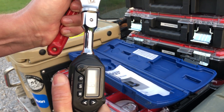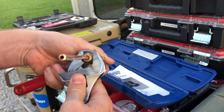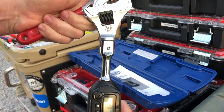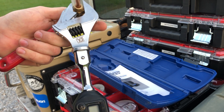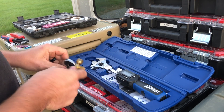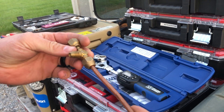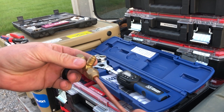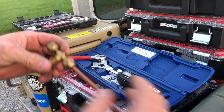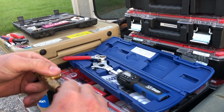You can see it's steadily climbing. There's a nice green light-up indication when you reach the target. If I was just using two 6-inch crescent wrenches to make that flare nut installation, I definitely wouldn't have gotten it that tight — I would have felt like it was good enough. So that torque wrench is really going to help you out making quality flares.